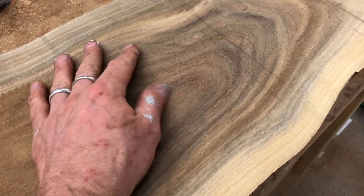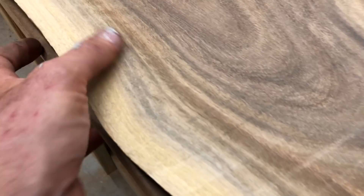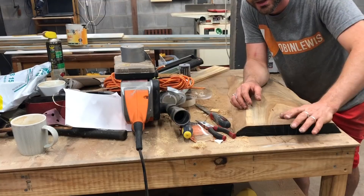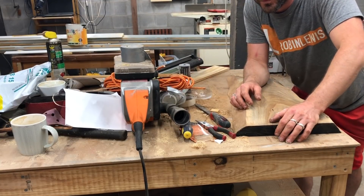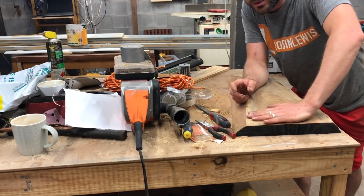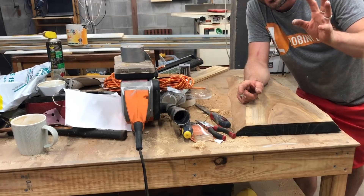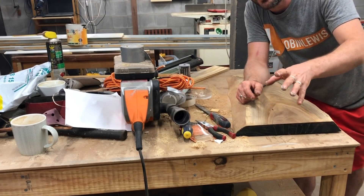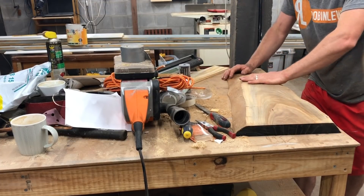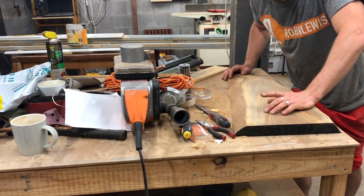I'm going to put this aside and let it continue drying — it's at about 15% — and then run it through the thicknesser again in about three to six months. So, carbide tips — is it worth it? It's hard to tell right now because they're brand new and as sharp as they're going to be. The real test is going to be their longevity. John Crawford from the Shop Store Podcast mentioned that carbide tips aren't as sharp as high-speed steel but they're a lot stronger, so the cut isn't necessarily any finer but they should last a lot longer. I'm happy to spend $300 on cutter heads as long as I get my money's worth.